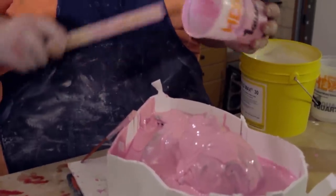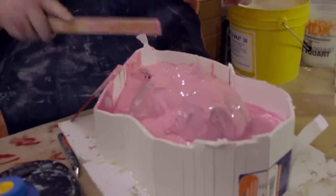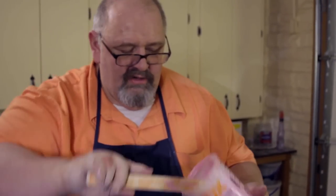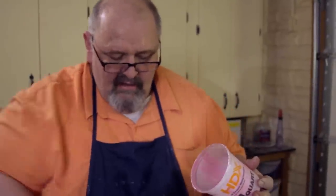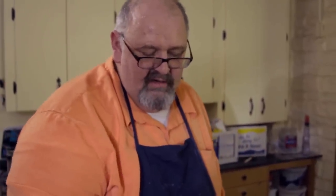And then we're probably going to have to do this same process two or three times. So you want to make sure it gets cured before you add the next layer. You can do it when it starts getting tacky, but you don't want to do it initially until it gets to that point when you start adding that second layer. My guess is that this is going to be about three layers, possibly four layers, to cover the whole piece really well. So that's it. I'll brush that on there and we'll see you later on in the process.